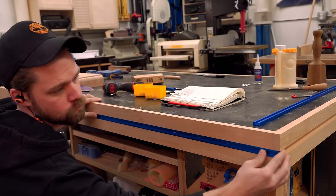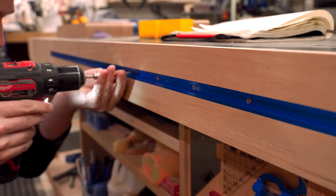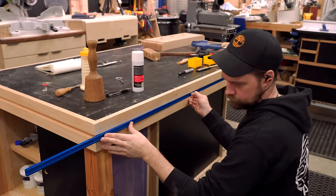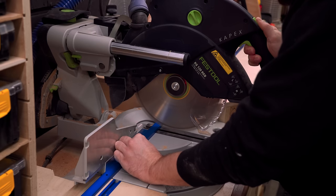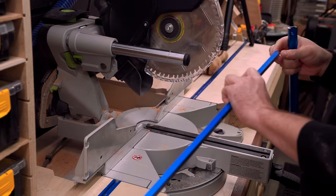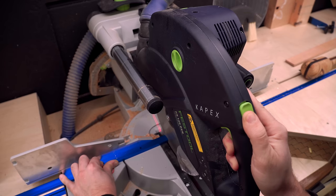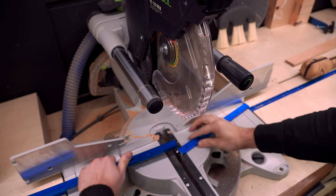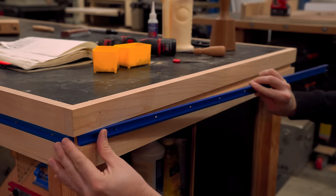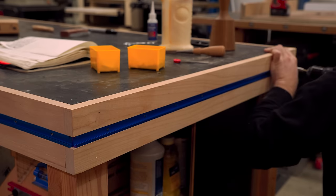I got the T-track from Rockler and it comes in four-foot and three-foot lengths. I designed one side to be four feet, but the other two sides needed to be cut down to length — I inserted a four-foot length into one side, added a three-foot length, and cut that down on the chop saw. There's no corner piece that you can buy for T-track as far as I can tell, so I just cut the ends raw and added a bit of blue Sharpie to match the anodization on the aluminum. It's pretty critical to line these up so they don't overlap each other so that the T-track components can slot in and out as needed.